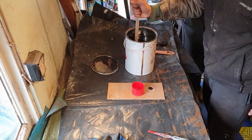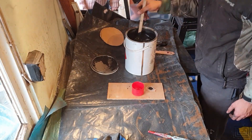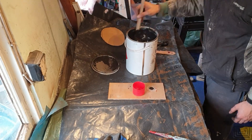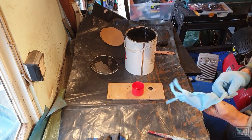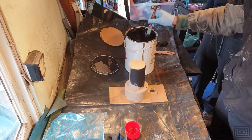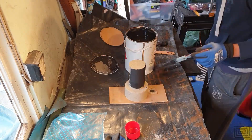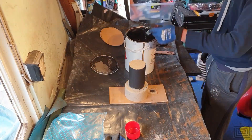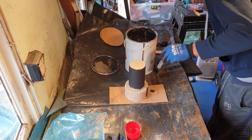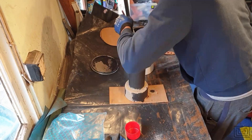Over here I'm going to coat the core. You don't have to coat your cores, but without coating them you might get sand sticking problems — your sand will stick to your casting. This particular coating is just a really high carbon content in an IPA solution. I picked it up from John Winter and it works really well. You'll probably see towards the end of the video that it really does help the sand stay off the casting, so I would recommend using something like this if you have the availability.